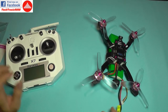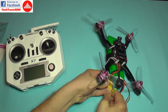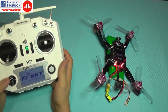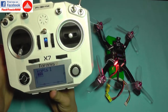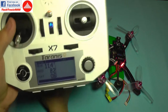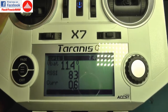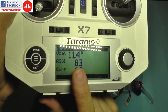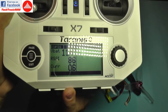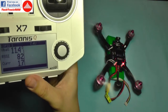Let's hear how it sounds — it definitely works. What's nice about this quadcopter is that telemetry from the flight controller, via the FrSky receiver, is sent to the transmitter. So you can see the battery voltage, RSSI signal strength, and drone current on the transmitter display. I can arm it and you can see live data.